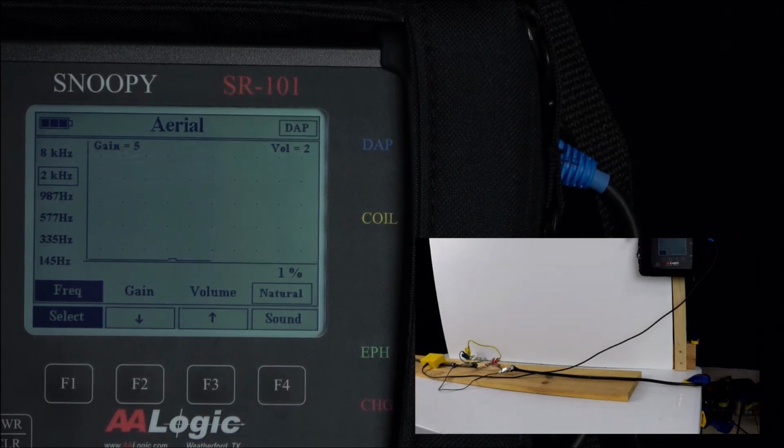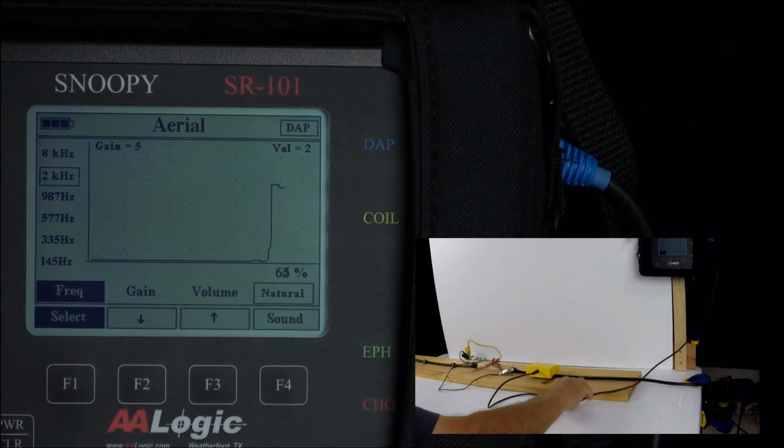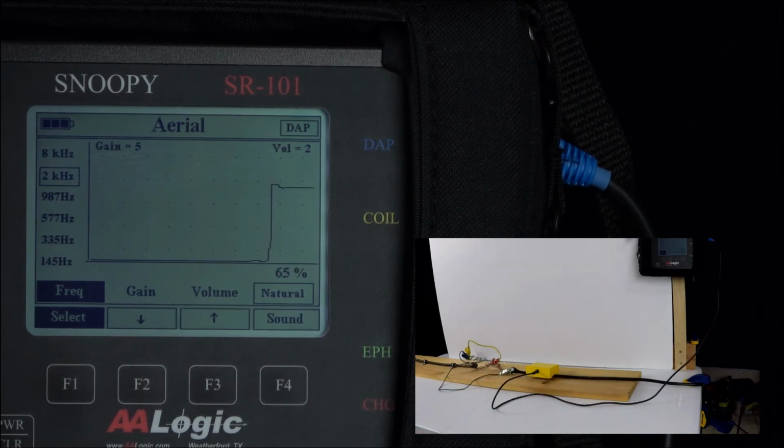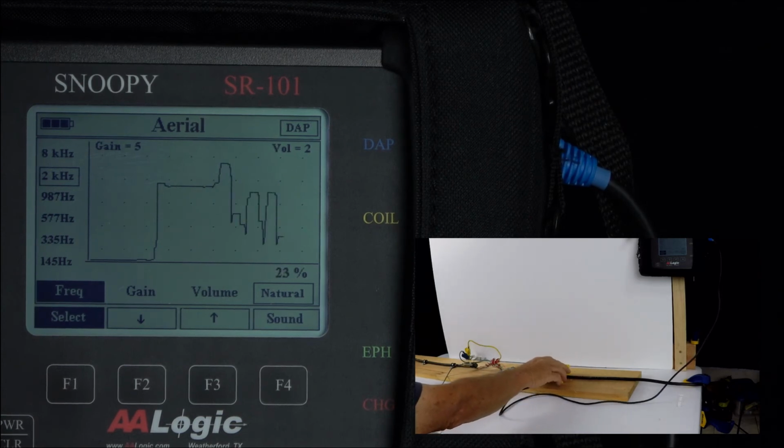At this point, you do not want to change the gain and look for the signal. If you're not sure if you've found the fault or not, simply move back to a point that you believe is between the fault and the transmitter. You should see the signal again. Verify you have the proper signal by moving it along the cable. It should move up and down.